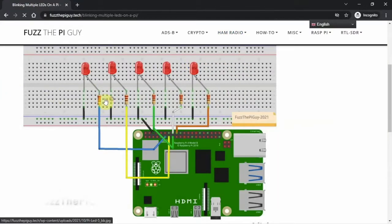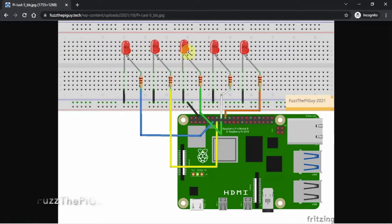So as you can see here, we have our five LEDs. The color doesn't really matter. These are 220-ohm resistors — I used 150s, 220s, 330s. You could probably get away with about any of them. We have the positive going into the resistor, out of the resistor to the GPIO. Then all the negatives coming off — which is the shorter lead on the LED — going to the ground. So we're using GPIO pins 17 through 22.